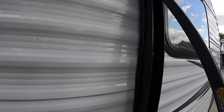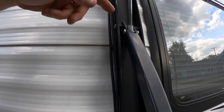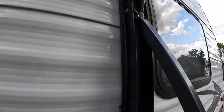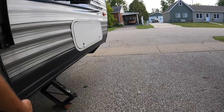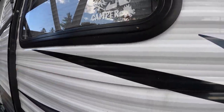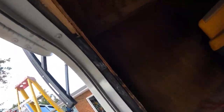So we have it ran down the awning here, zip tied against the edge. I was going to run it inside this trim piece, but this thing swings back and forward. One time or another it's going to catch it and cut through the wire. So I just drilled two little tiny holes and put zip ties all the way down because we're going to go underneath the trailer and into the trailer. I want to put the charge controller beside the bed so I can monitor it. That way you can charge your phones with it too.